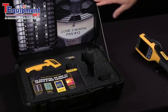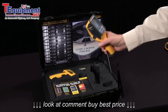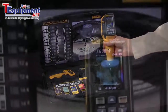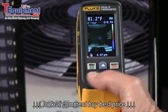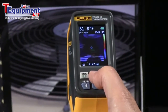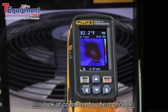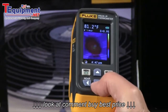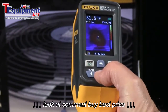We have a simulation of a fan motor. To find a hotspot with the VTO2, you simply start with the visible light image and focus in on your subject, then press the up or down arrow to blend in more color to show you the temperature differences, showing you the exact location of the hotspot.